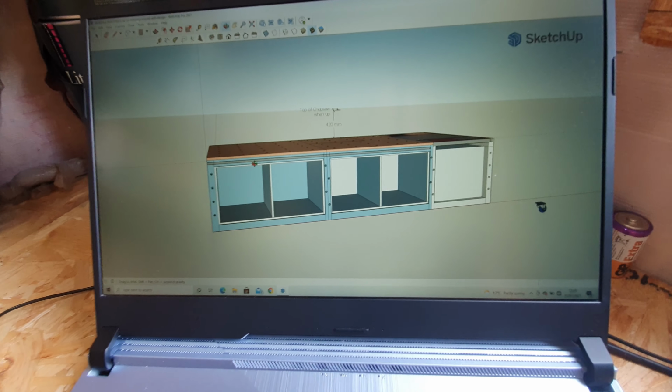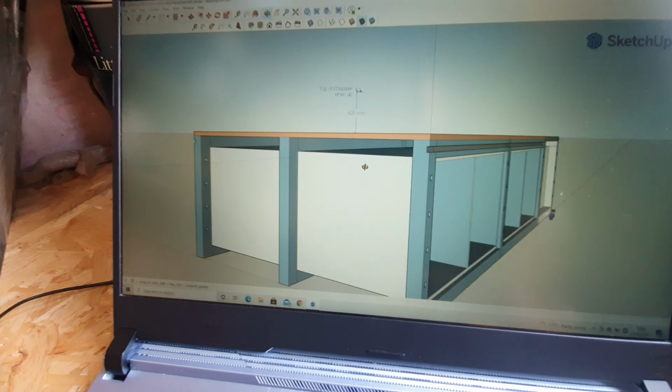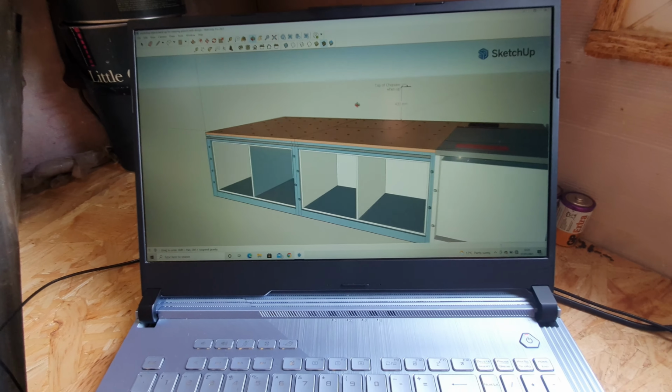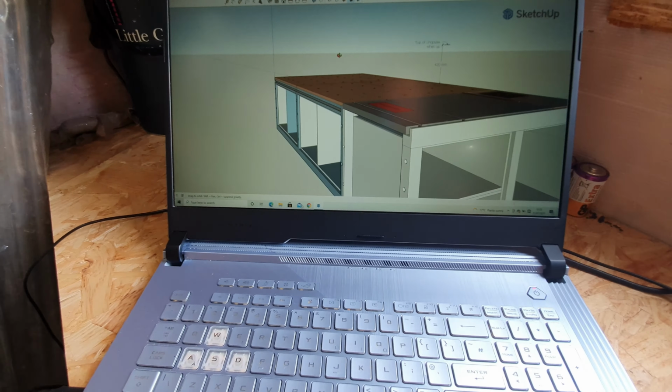We then have these channels here. I turn it around to then run a clamp in there, because you have certain clamps that run in these channels, and they will clamp this sheet material to the bench as well. So it's a little system that helps you machine large sheets of material, for example, and machine edges basically, rather than struggling and clamping your piece to the bench. So anyway, this is the job we've got in hand.